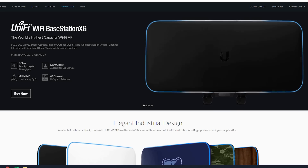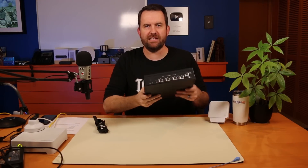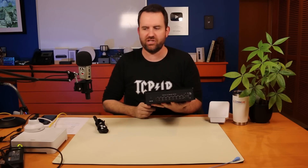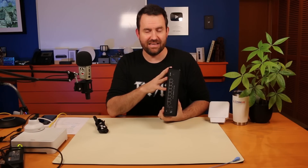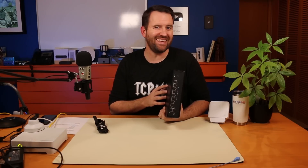With this switch you can also power the UniFi Base Station XG — that flat panel access point made for stadiums. Imagine doing a stadium deployment with four or five Base Station XGs pointing at different areas of the crowd; you could use one of these to power all of them, mounted up in the rafters. This also works with the UniFi XG access point. On top of that, it will auto-sense 802.3 AF, AT, or BT, so you can power AT devices like LED panels, G4 Pro cameras, the in-wall HD access point, the HD access point, and the EDU access point.